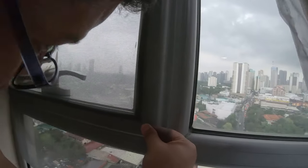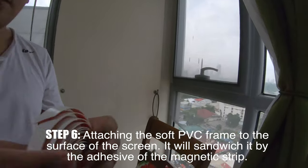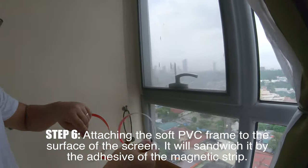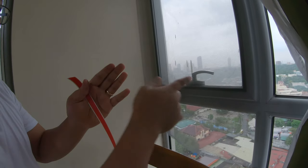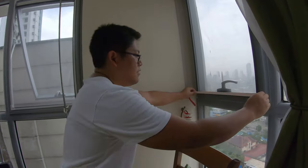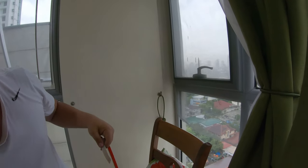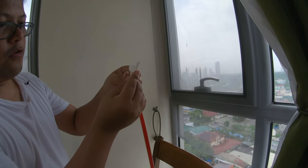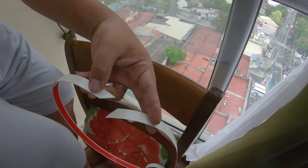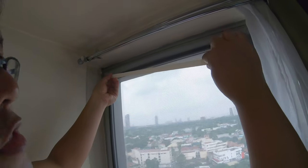Next, we'll stick the screen onto the adhesive. This technique is better because it keeps everything even. Make sure the corners are aligned first — the very corners. Then as you press it down, pull it slightly to stretch it. Now this is the soft PVC frame — you put that along the edge. It sandwiches the screen in place. It also has adhesive. You cut it the same way, with a 45-degree corner piece added so it doesn't come apart. You can use a square for accurate 45-degree cuts. Now the screen is sandwiched.